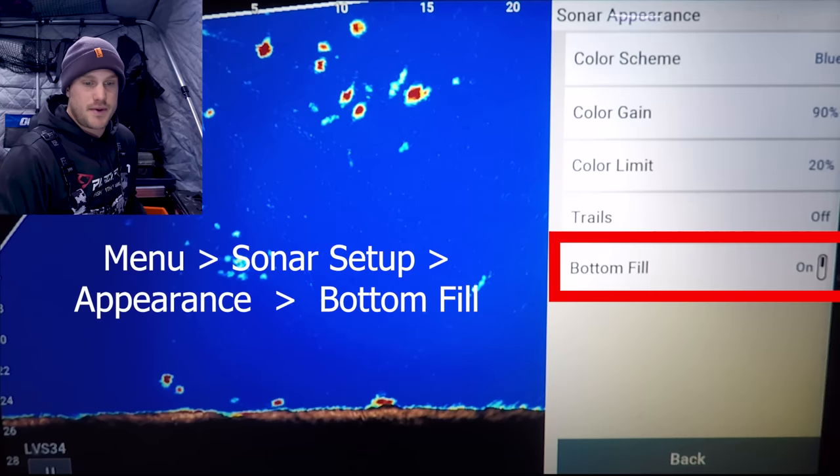Sometimes I'll even do full and it really gives a clear picture of what's going on, but then you have less screen space for the forward mode view. Compressed range I normally have off — not a huge difference when it goes on and off. Going back into sonar setup: noise reject — I like to keep that on high. On medium or low it gives you a lot more stuff on the screen, and noise reject on high reduces that extra background clutter that doesn't seem to give me a lot of usable information.